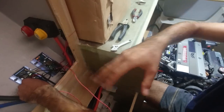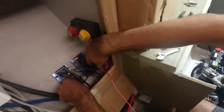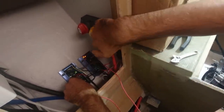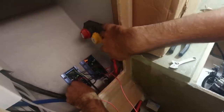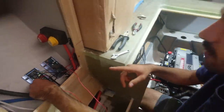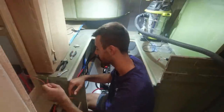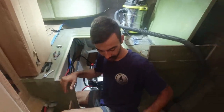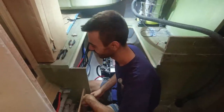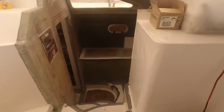At least we know they power up. The ignition wire I'm holding on — when you press ignition, that terminal will get power and they'll power up. The power lead is hooked up to the constant power from the house battery into a 15 amp fuse, but it should be on the ignition so it shuts off when the motor goes off. So when you click ignition off, they power down. Brilliant! All that five hours of stripping seven-core wire yesterday has paid off.